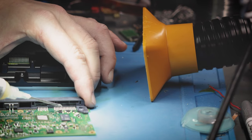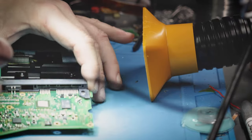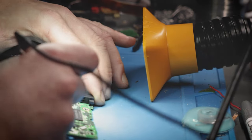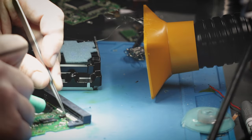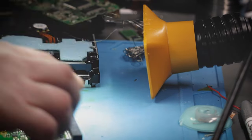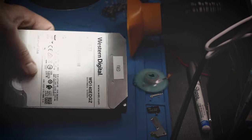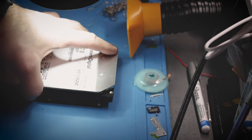The best way to deal with this fuse is to remove it. I have a donor board here with a fuse I can salvage. I'll probably need more fuses because I don't know how many boards I have like that. I'm putting a bit of flux on here, getting my hot tweezers, and removing this component. I'm salvaging a fuse off the older donor board - the fuses are all the same and still work on these newer boards. Unfortunately I was switching lenses and forgot to hit record, so the 14 terabyte repair wasn't captured. But that one is fixed.